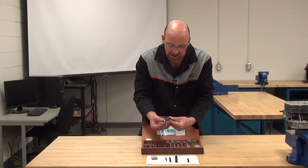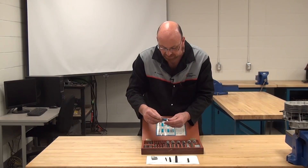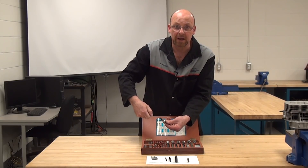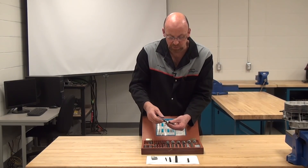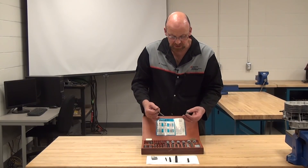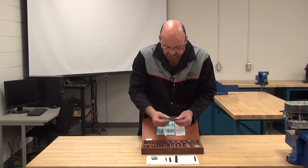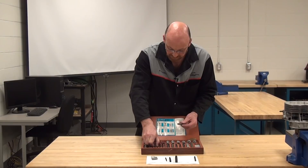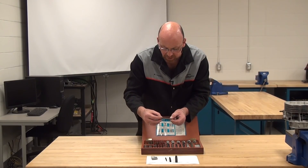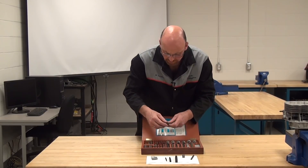There's a bolster drive with slots that fit and correspond with the particular tool. Collars can be used to space it out down into the hole, providing lots of downward pressure. Then a wrench, socket, or your preferred tool is used to remove the fastener. The pipe tap style doesn't use a sliding screw like the adjustable one, which can be adjusted for a really deep hole with a long broken fastener by extending it down accordingly.